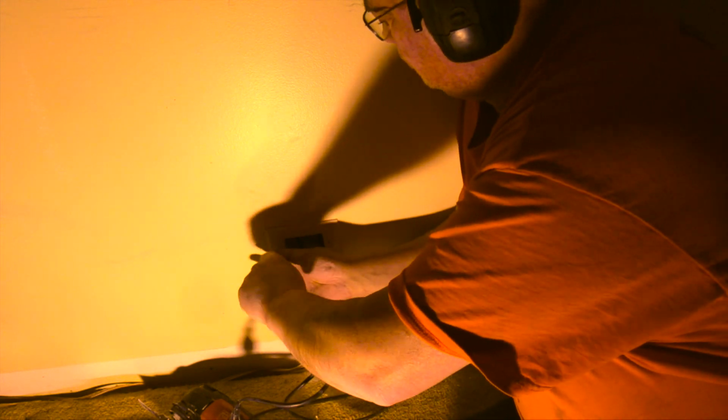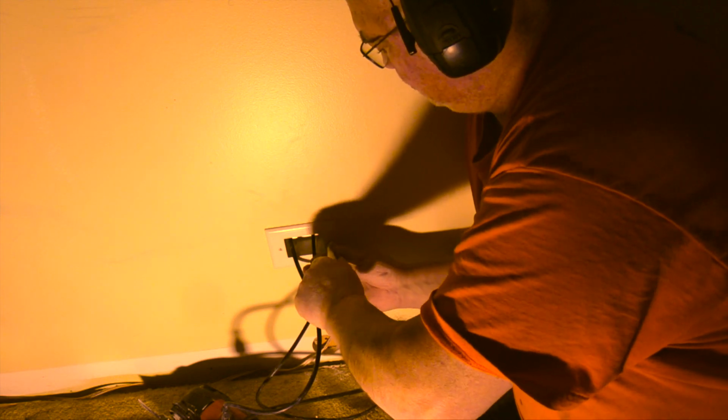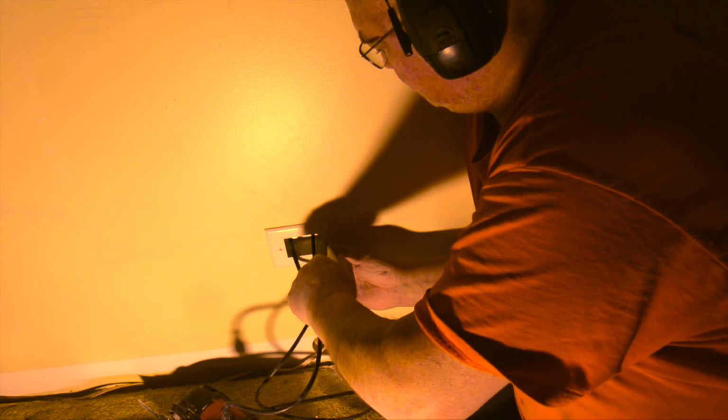I installed the lower faceplate with the channel facing up so the wires would flow smoothly. As you rotate the screws to the right, the locking wings fold out into position and then begin to tighten. Do not over-tighten the screws. The wings are fragile and a new cable plate is over $10.